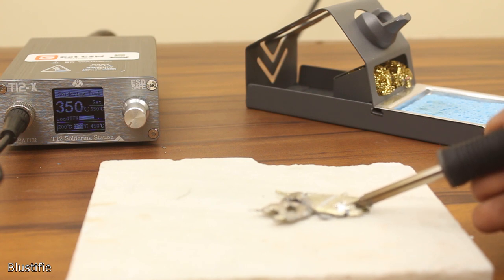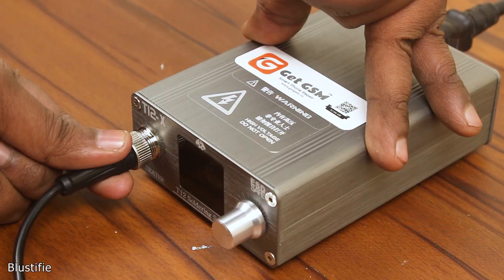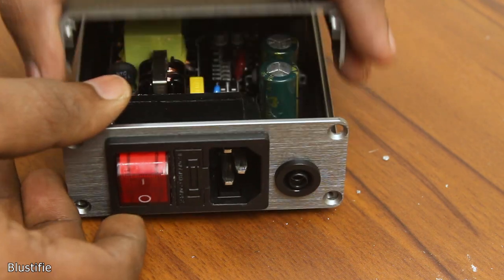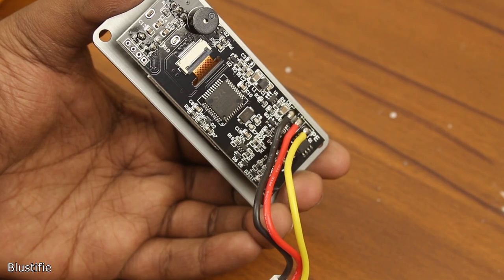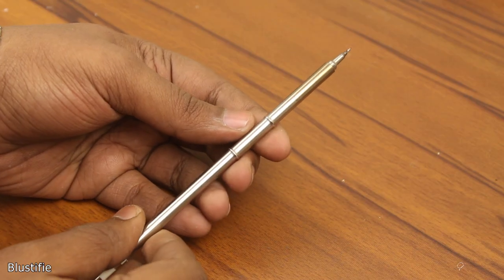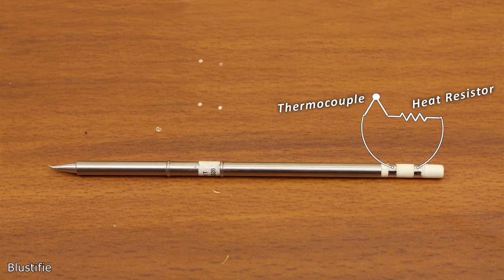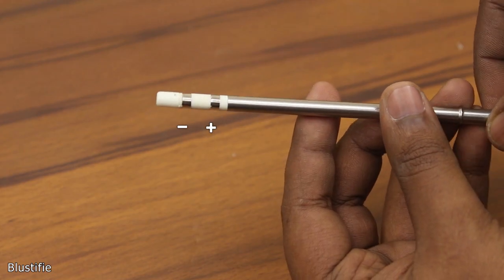Finally, to kick it up a notch, I tried melting this big soldering joint — actually a huge amount of solder packed in a small area — which it did in a couple of seconds at 350 degrees Celsius. But this type of heavy solder joint loads the element significantly, as shown on the display. This kind of performance increased my curiosity to reverse engineer the design, so I tore it apart. After unscrewing the front and back panel, it is very easy to completely disassemble the enclosure. This board is just a power supply board that produces 24V. The other section is the brain of the soldering station — the main microcontroller that takes input from the rotary encoder and from the thermocouple placed inside the soldering tip, processes it, and provides output to the heating element of the tip. Yes, the heating resistor is in series with the thermocouple inside, so apart from the grounded body of the tip, it has two main terminals: positive and negative.